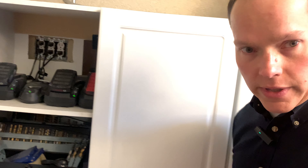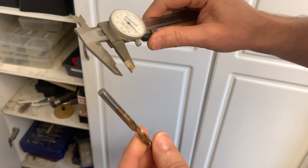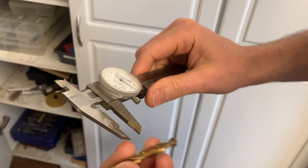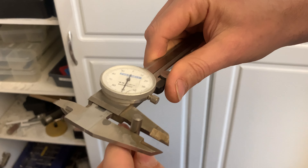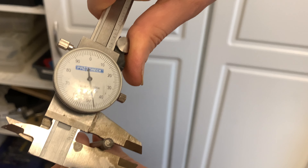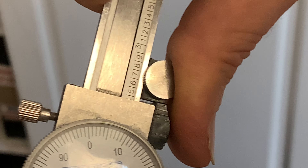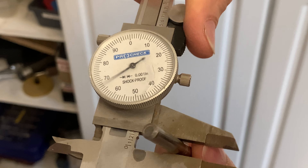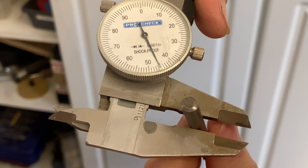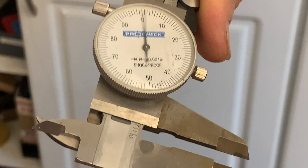So the way to read it — this one was in the quarter inch slot. When you measure a drill bit, that's probably the most common thing I use the calipers for. You don't want to measure it on the fluting of the drill bit; you want to measure it back on the little end. So this is measuring at two hundred and forty-six thousandths — there's the two that's revealed. It's not exactly a quarter inch, but it's pretty close — it's four thousandths off.